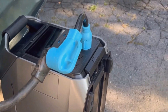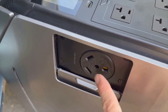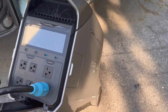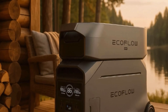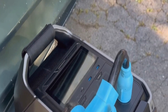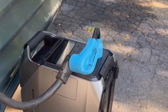I get a lot of questions from friends and family about safety and battery life. The Delta Pro 3 uses automotive-grade lithium iron phosphate (LFP) cells, which are way safer and last longer than standard lithium-ion batteries in your phone or an older generator. The battery pack can go through about 4,000 cycles, so with typical use, you're looking at years before there's any drop in output. There's a five-year warranty too, so EcoFlow stands behind it. For home backup, it's got an ultra-fast switchover capability of 10 milliseconds — about as long as blinking — which is crucial for smart home gear, servers, or a fridge full of groceries.